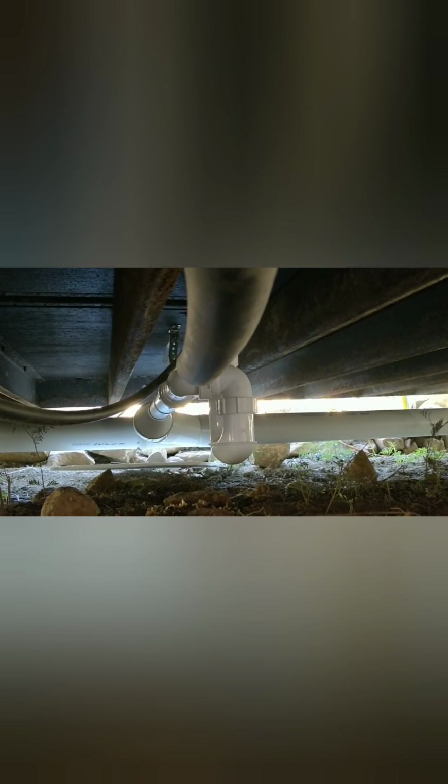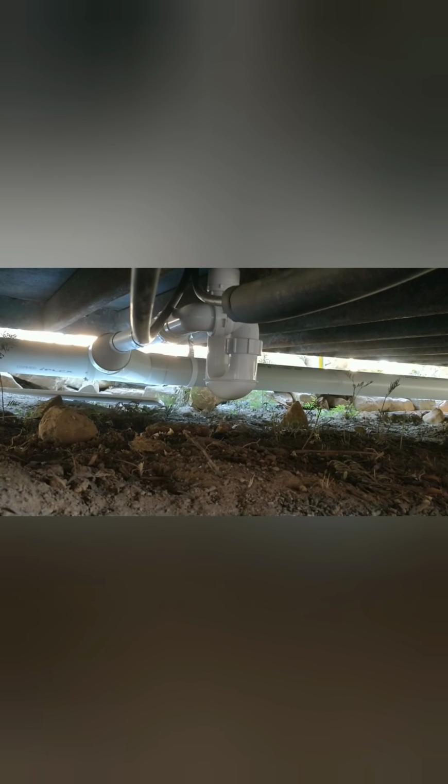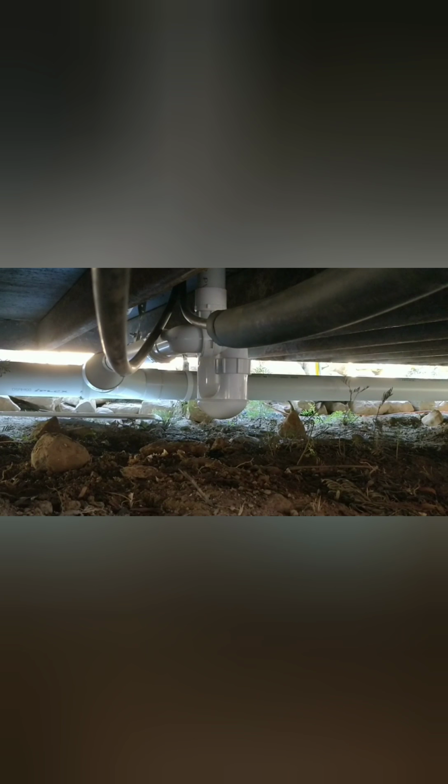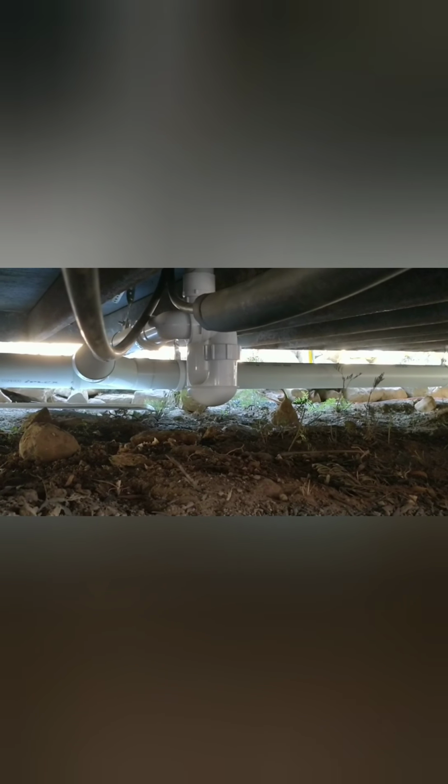There's that extra S-bend I mentioned for the kitchen, again trunked into the main line there. The other thing that's of interest, which we can't quite see, but again, because of limited space, the dishwasher outlet actually needs to go down through the floor and will connect under here. So it'll just be a little bit of 12-13 mil, so sort of half-inch pipe.